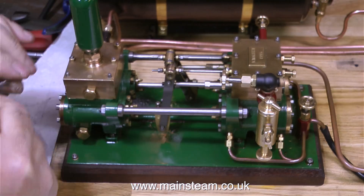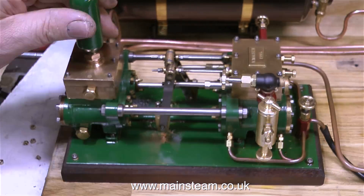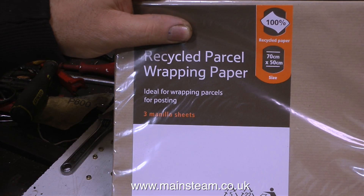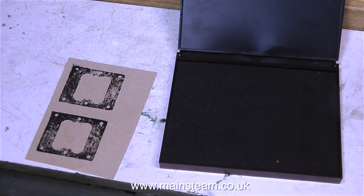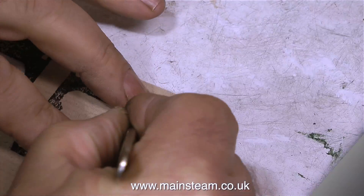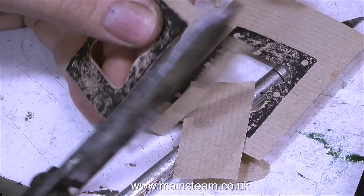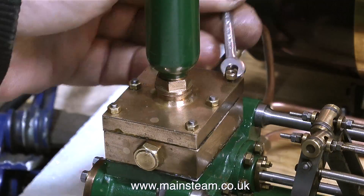I've had problems with this pump, mainly due to the silicone rubber infusion, but anyway, that's gone now. It does need some gaskets, so I'm going to make some — I'm not going to use silicone rubber, perish the thought. Instead, I'm going to use some brown paper for wrapping presents and parcels. I've shown how I make gaskets for model steam engines many times, normally using gasket material, but this brown paper is a bit thinner. The principle is the same though: I use the ink pad and the main cylinder cover, or the water chest cover in this case, cut out the centres, punch the holes, and then finally cut out the shape of the gasket. Don't forget, if you're using this stuff, it is brown paper — it is not strong, and it will tear very easily, so be careful as you put all the parts back together.